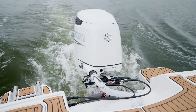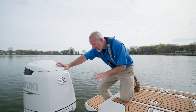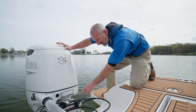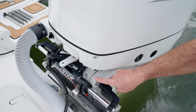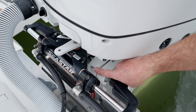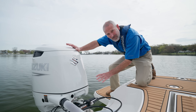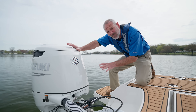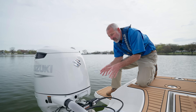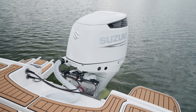Now, if your boat has an outboard, this one could save you big bucks in the long run. Make sure you come back to the swivel bracket and steering arm and look for Zerk fittings. Different manufacturers have different instructions on how often these should get hit with a grease gun, but make sure you check it out — because if this bearing fails, it can be catastrophic. You can lose the ability to steer your boat, and fixing it usually requires pulling the entire engine off the boat. That can cost big bucks.